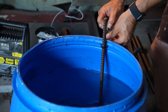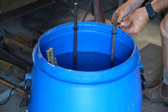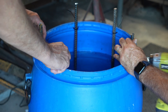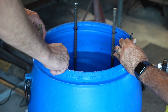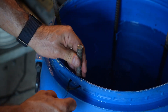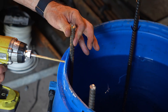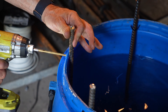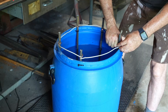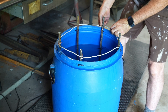This is steel that is going to, in the electrolyte, collect all the carbon and rust buildup — it's going to be attracted to that. One thing with using sacrificial steel is you want to make sure you can cover as much surface in the electrolysis tank as you can. Here you can see we're using rebar — we've cut it into pieces and we're spreading it around the circumference of the container, securing them into place. We're also tying them together with some copper wire so we only have to put the positive charge on one, and that charge will carry through to the other pieces.